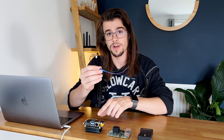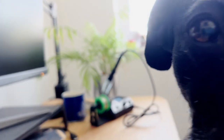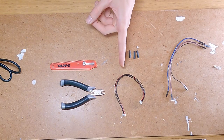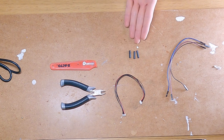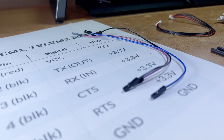You're also going to need a 6-pin to serial connector cable to do the physical connection from your Pixhawk to your device. I'm going to show you how to create this. To create a serial cable you will need: 3 jumper wires, a 6-pin connector cable which should come with your Pixhawk, shrink tubing, and a soldering kit. I also like to keep a printout handy of the wiring for the connector.